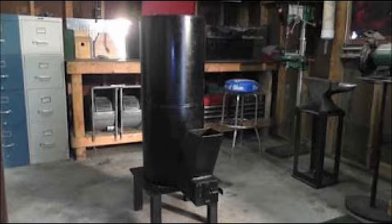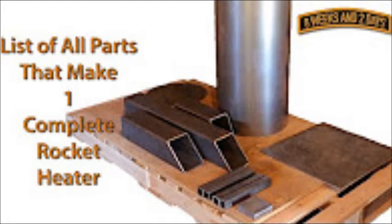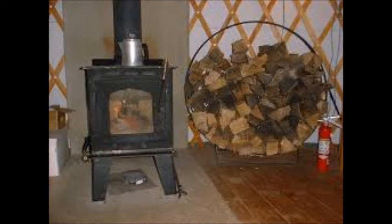Here are pretty much the parts I have to have. The tubing is five-by-five tubing, all cut to length and angled by the steel company I buy it from. All I have to do is put the thing together — the bottom plate, the top plate, the four legs, and that little piece of metal on the corner. That piece welds onto the bottom of the five-by-fives when they go straight up into the barrel. It holds it up from being on the floor. The hole for the tube has to be exactly the height of that little corner piece, because that holds up the center part inside.